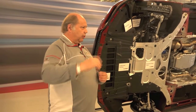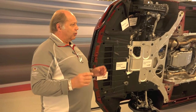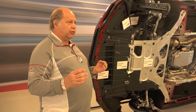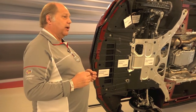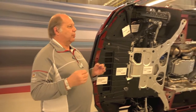There are two outboard coolers which you can see at the front of the vehicle in the two corners behind the grilles. These are all series-attached, so you end up having three intercoolers providing that same function — one on center and then one on each side — and that will allow us to maintain inlet temperatures and maintain our full power capability.